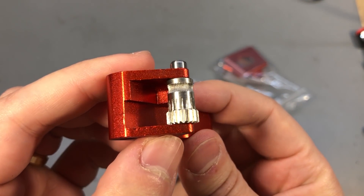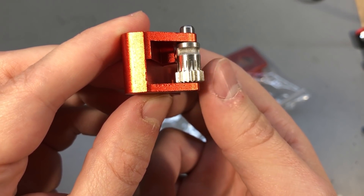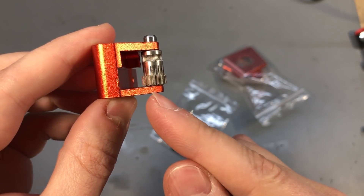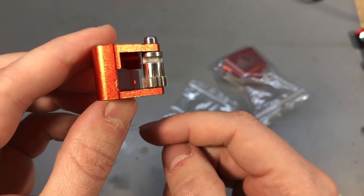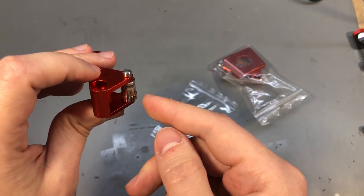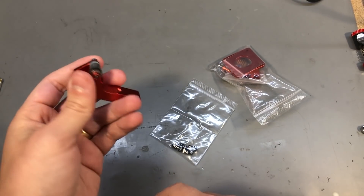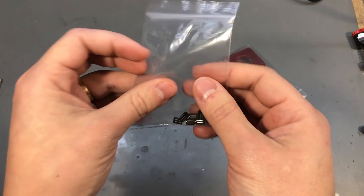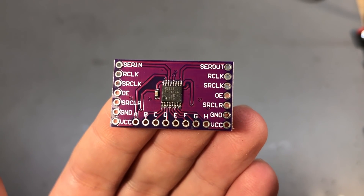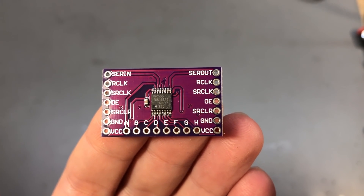This one is already fixed because I went to a local CNC shop and the guy there manufactured the shaft to be exactly the correct size to replace that 3mm screw. But what I wanted to show is that this seems to be a newer revision — if you look at the teeth on this wheel they are angled, so they will not bite into the aluminum holder anymore. It seems they revised the wheel but are still using a 3mm screw in there — but no worries, I fixed that at the CNC shop and I've also got some replacement bearings just in case.